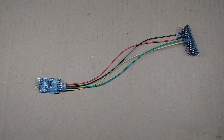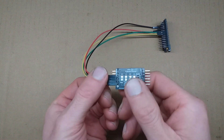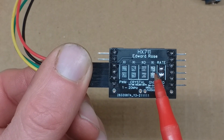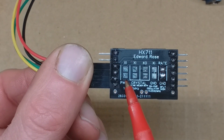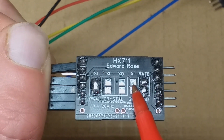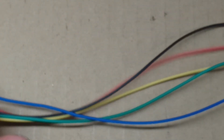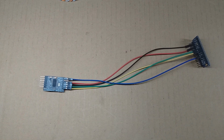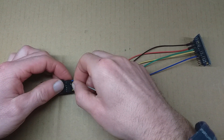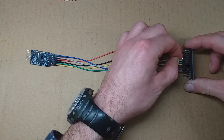Next, let's use an external PWM signal from the microcontroller to control the sample rate instead of the internal oscillator. To do that, we need to cut the track between the XI pin and ground, and solder a connection between the PWM pin and the XI pin. Don't worry when cutting the track — there are no delicate tracks in line with it, just the ground plane. The 20 picofarad capacitor is already on the board; it decouples the DC component of the PWM signal. The example code uses pin 3, but you can configure PWM on other pins if you want.